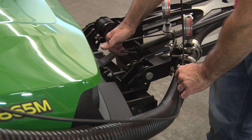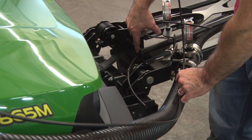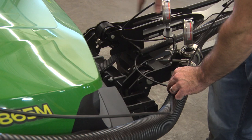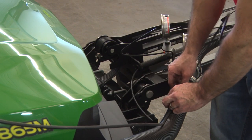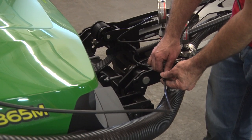Okay, as you're routing the hose, release hose down the water line, you're gonna notice on the boom there are two quarter inch air lines. One of them's coming out of the tube on the boom. That is your release line, that's the one we're gonna connect to. The other one is for your pressure gauge, which we'll route at another time. So we'll cut this to length, we'll use another one of those connectors and fasten them together.